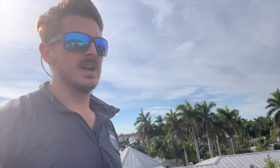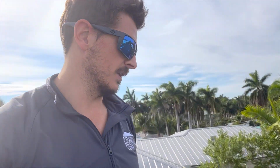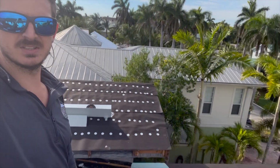So we're doing that off of tall ladders with a ladder jack. I'll show you what that looks like in just a second as we're changing this fascia around the building, which is going to take us a few days. It's about 370 feet of 2x8 cedar fascia, and we're doing that with stainless steel nails. So we've got some long stainless steel nails.